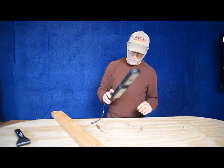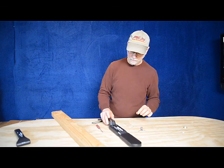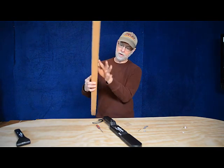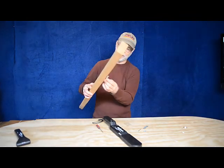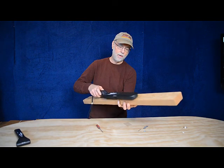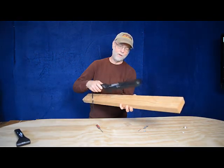Let me give you an example here. We'll turn it on — it's going to beep one time because it's actually picking up the pieces of metal here. So we'll set it down and just let it do its thing. Now, if I take this screw and I just hold it in my hand like you see here — I don't have any rings, no metal tape on my fingers or anything like that — we're holding that screw right under that board. We take our Lumber Wizard, we scan it over the top, and there it is. You can see the laser will fire, and that's telling us where that piece of metal is.